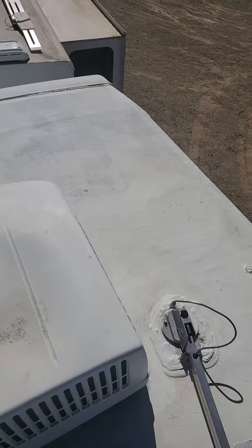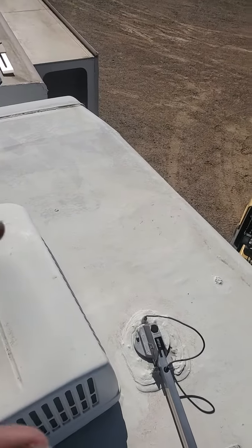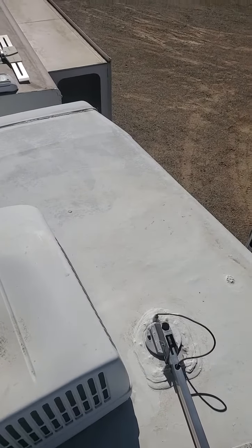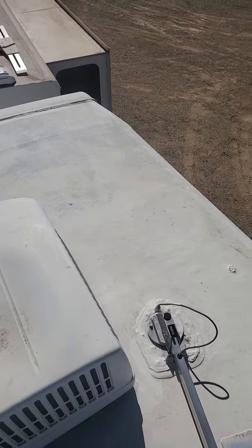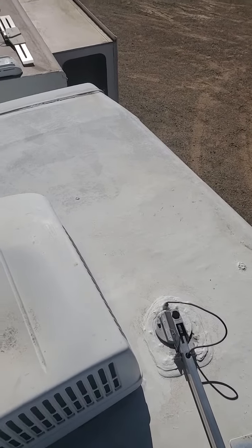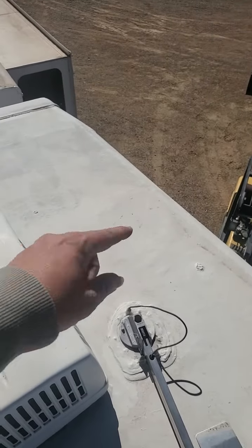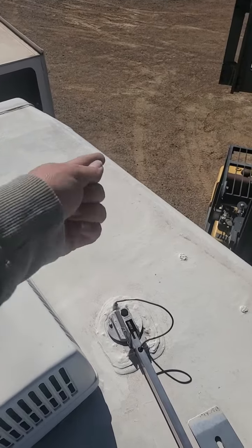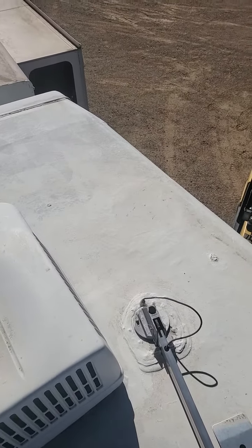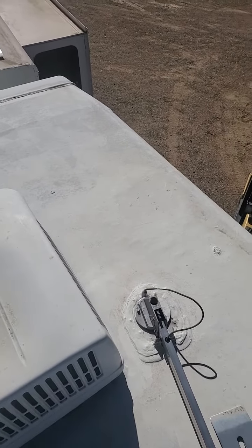The area that we're a little bit worried about — you won't really be able to see much — is right about there. Basically what happened is there's a hole that has been cut into that roof before this roof was put on. Somebody should have patched that. Unfortunately, we don't know the original owners, so we don't understand what exactly happened right here. There's a soft spot, and if you feel around the edge, you can tell that it looks like it was intentionally cut out and never patched. I'm not quite sure what the significance of that was.